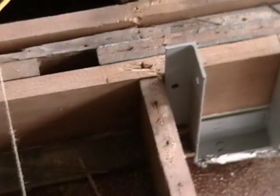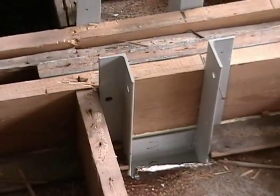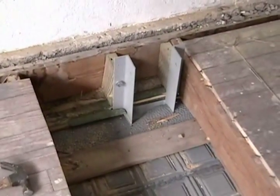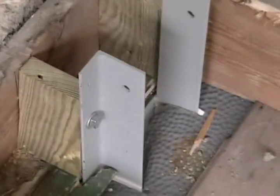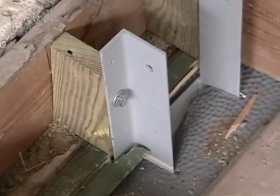You can see where these bolts are that will go through to anchor all the way through the joist support. On the other end, I had to put spacers in here, which are anchored to the joist and the joist support, with some big bolts going through there.